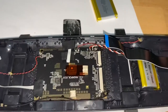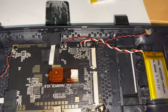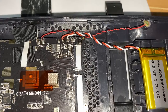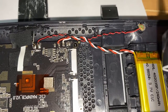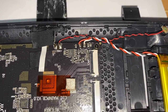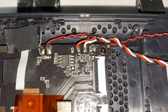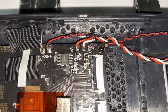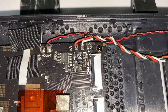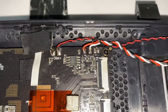Another thing it doesn't show in the video, well it kind of shows but not really clearly. We're just going to cut the white wire off and put some tape over it or something, so you could just cut it anywhere. This end in the middle down there, just leaving it bare - you don't want it to be touching anything. But as you see, the solder points are exposed. So you could cut the wire off right there where it's soldered on. The other two I'm going to get the soldering iron and heat those solder points up and unsolder them.